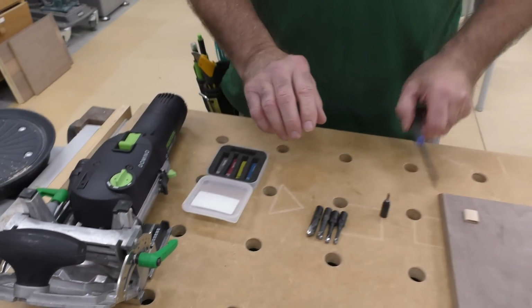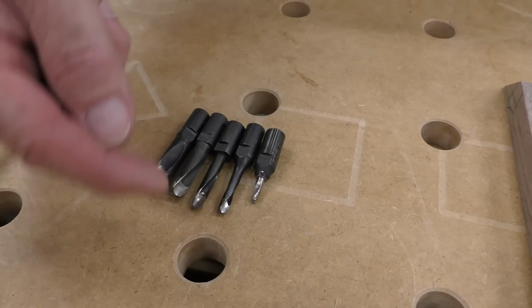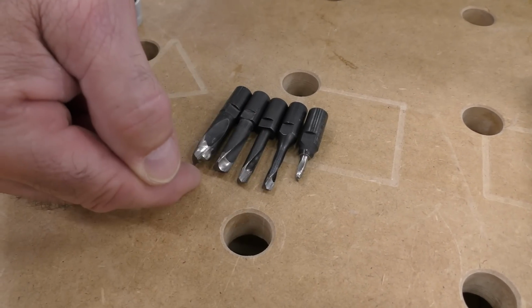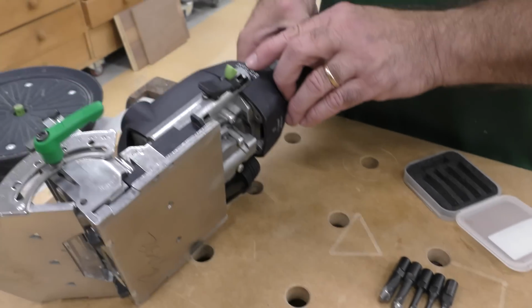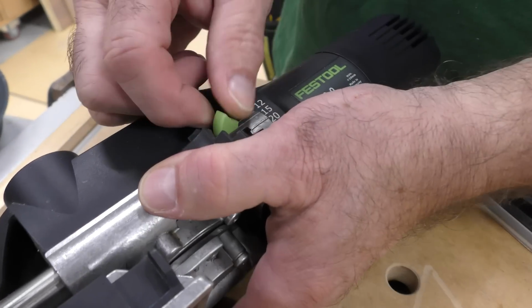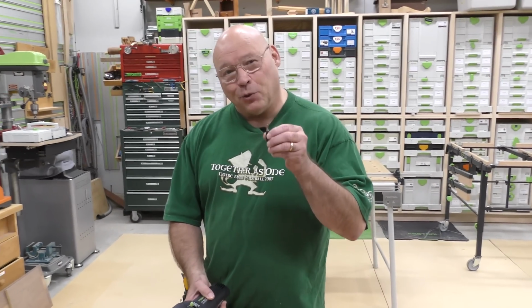Now here's the confusing part, and I brought out all the cutters. For the 500, there's a 5, a 6, an 8, and a 10. Here's the 4. So the confusing part is if we look at all of these, the 5 through 10, they're all the same length. This 4 millimeter is 10 millimeters short. So follow me. The setting on here to go equidistant into each side, you set your domino depth on the 500 to 20. It actually is only plunging 10 millimeters because this is 10 millimeters short. So there you go. Half of 20 is 10.